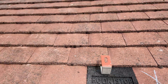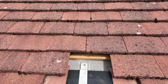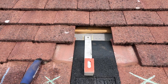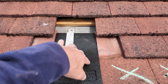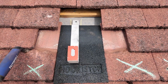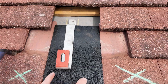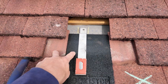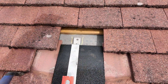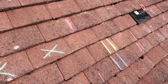We're going to take tiles off properly, locate the rafters, and start putting them in. The first hook stop is now on — all done. You can see there's hardly any lift on that tile there, and the tiles have gone back really nicely. For the second one, you can see what we've done: we've marked out where the rafter is, taken out four tiles — the tile we're replacing, plus one to each side and the tile above — just so we can actually get to it and screw it in, then dress it back.